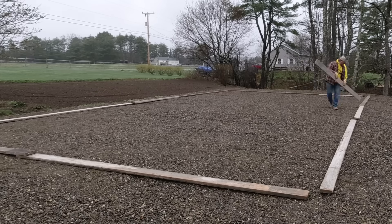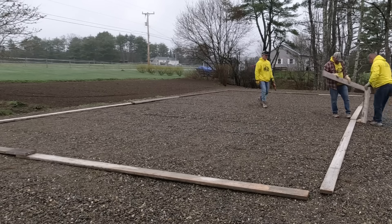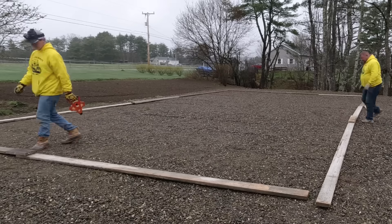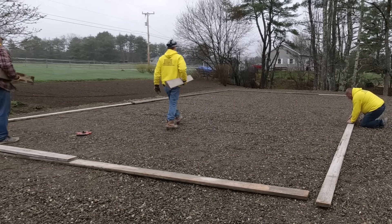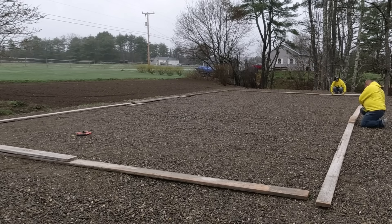Now the gravel base was actually done by the homeowner — he's done some stuff like this before. He kind of grubbed off the loam, the grass, got rid of that, dug down about 18 inches, and put in about 12 inches of this crushed rock type of gravel sub-base and compacted it really hard. We had a really hard time driving the pins in — it was packed down so hard. What's really good about this type of sub-base is it's permeable, so when it rains, water's going to run through it and drain out. It won't puddle up at all.